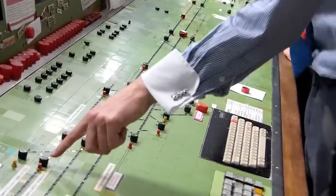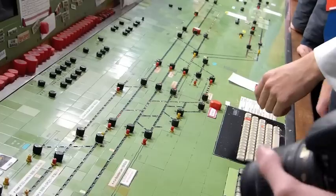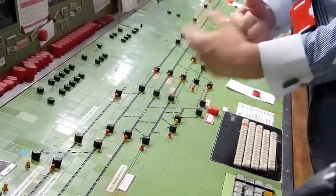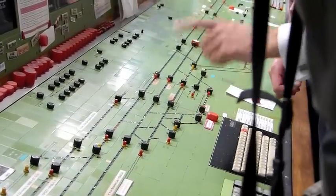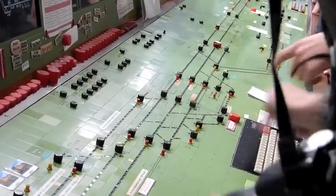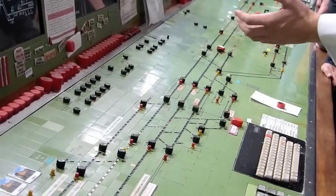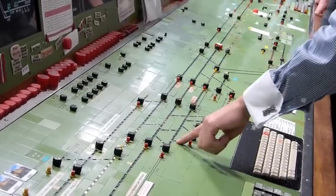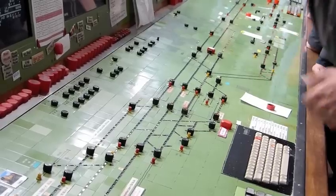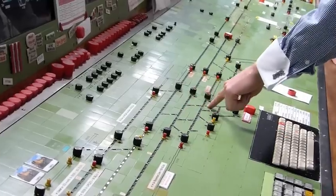This route's been used, so if you want to cancel and put the red arrow back to the 12 o'clock position - white route lights die away. Although there's nothing in the rules that says you have to, we always leave this in the set up for straight running position. Turn it so red is towards me, and then the next red exit button on the straight route, follow along with your finger, will be that one. These points will go back over because you last used them in reverse. Most of the points will just stay in the position you last used them until you call them the other way. Some of them - for example this one here, 337 - that protects runaway movements coming out the up reception. Self-restore it - after a few seconds it will just put itself back.